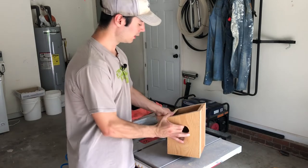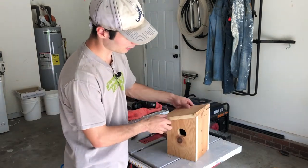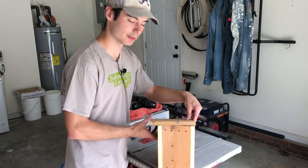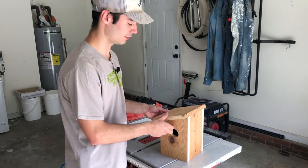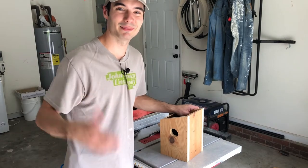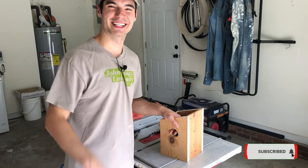So I'm going to put the lid on now and nail it on. I'm going to put all the overhang on the front to back, so I'll have about two inches out front, flush on the back so it goes against the post, and about a half inch overhang on the left and right sides. That's it for this video — I hope you enjoyed it. Hit that like and subscribe button and I'll catch you in the next one.